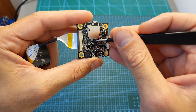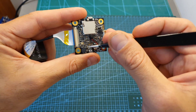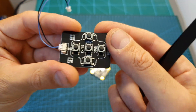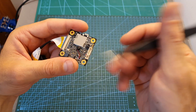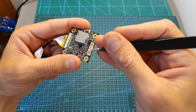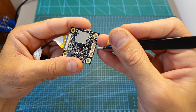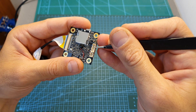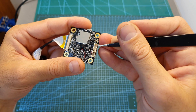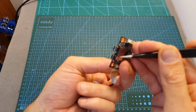On the main board of the camera we can find an onboard microphone, a micro SD card slot, two LEDs that indicate the camera mode, a buzzer, and a connector for the OSD control board — which is the only way to configure the camera since Wi-Fi is not present. Next to it we can find a six-pin connector: the left pin is VCC with supported voltage between 7 to 25 volts, then ground, video out, a VBat sensor to display battery voltage on the OSD, and two RC trigger pins to capture a photo or start/stop video recording. On the other side there is a micro USB port to access the micro SD card content.